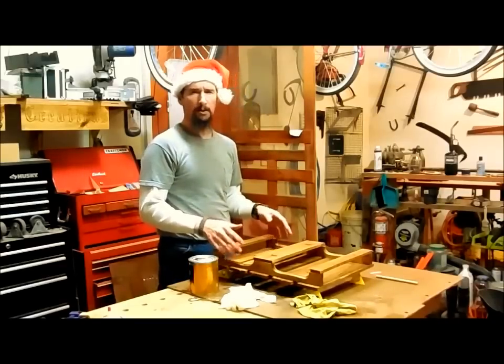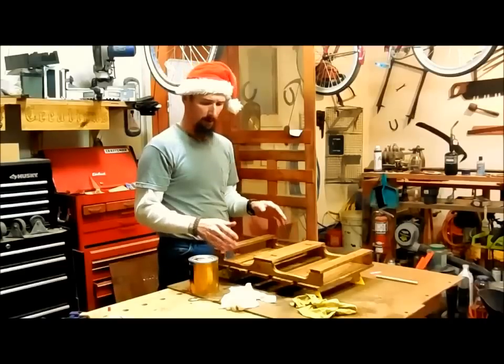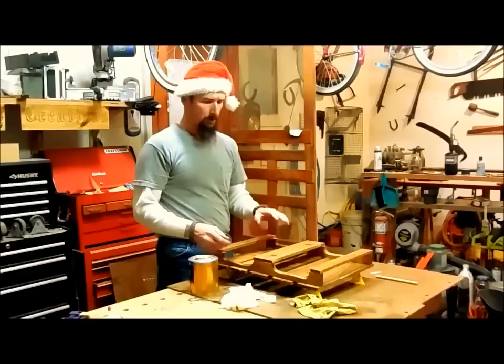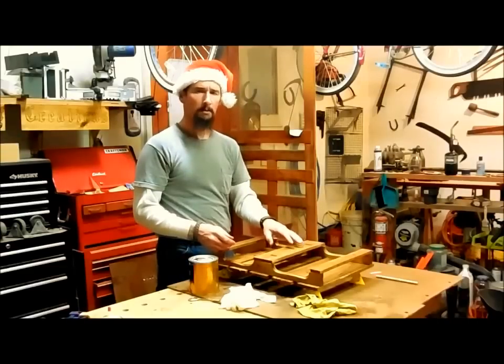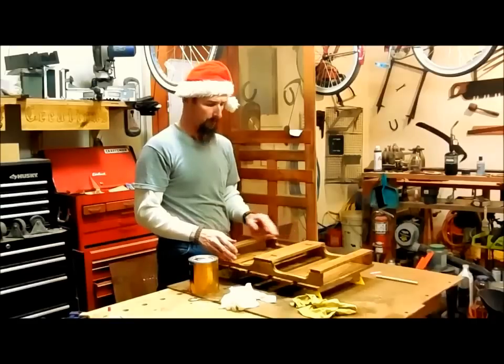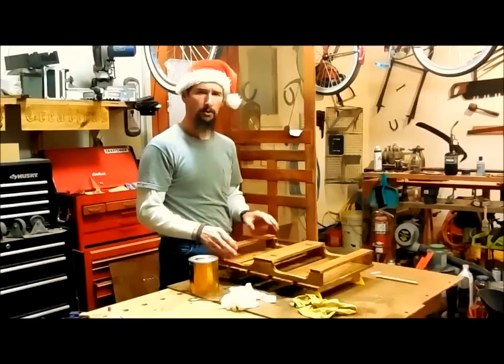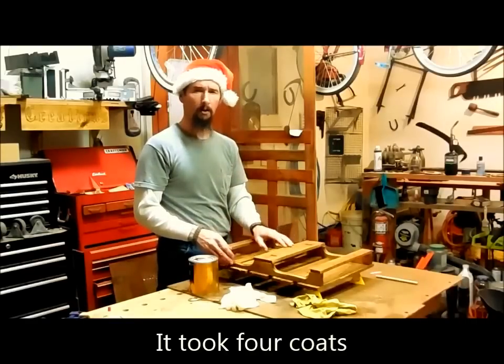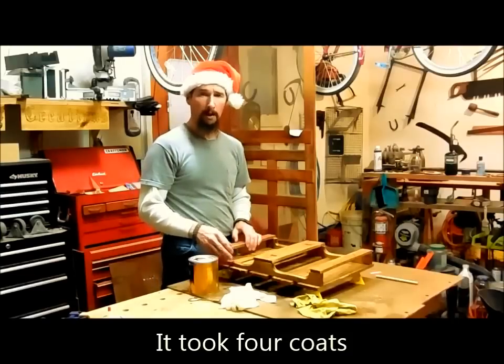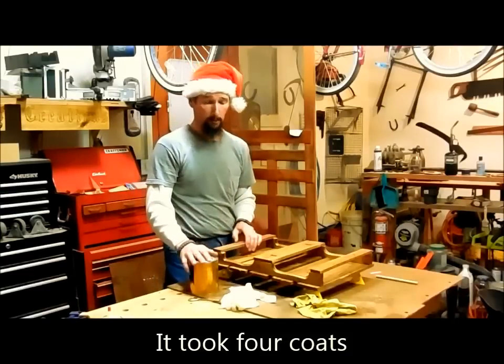First coat will go on and soak up pretty quickly, and it'll slow down a little bit with every coat thereafter. Usually three coats of urethane if you've got a nice planed surface. It is beautiful. If this is a rough surface, I'm not sure how long it will take, but I know it will take longer between each coat. So I'll get started on that, and I'll save you from watching that part.